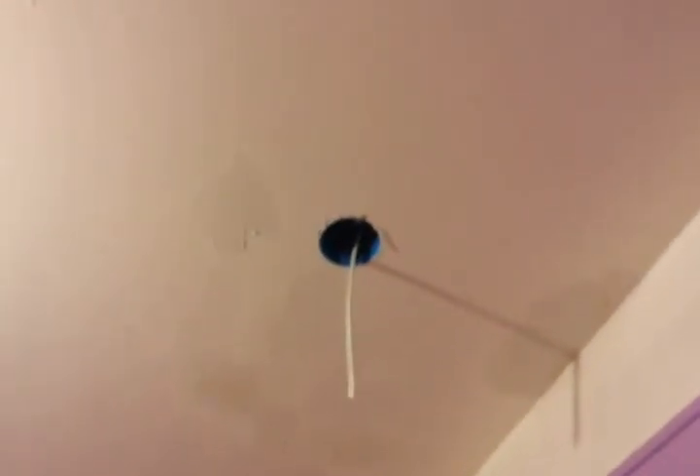This is the wire coming from the basement. I took another wire going into the one in the hall, comes out, goes back into the second bedroom, comes out, goes back in, and then ends up here. So this is all the wiring. Now I'm going to take you to the basement and show you. This box is the first smoke detector that's going to be installed in the whole wiring. It goes in, comes back out, and then goes into the laundry room — there it is.